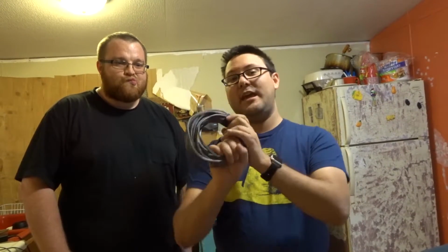And basically what that means is just the grade of the cable. The higher the numbers go up, the better it is at not having interference from other things and all that other fun stuff that goes along with it that we're not going to get into in this video. So here's what you need to know. Cat 5e and up, pretty good. We can carry gigabit speeds over this cable. It's not certified for it, but we can.